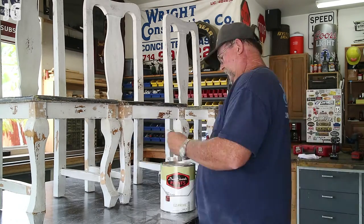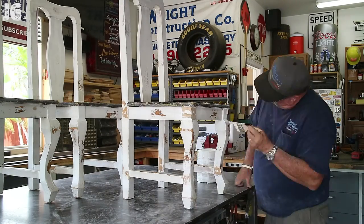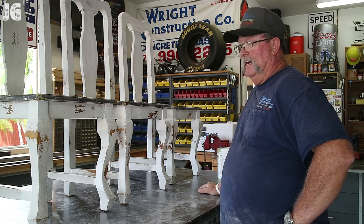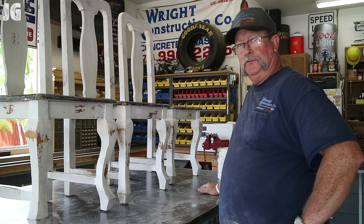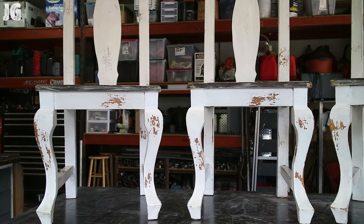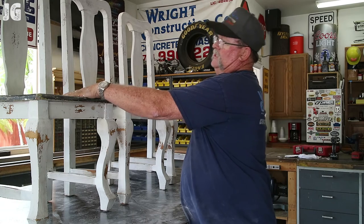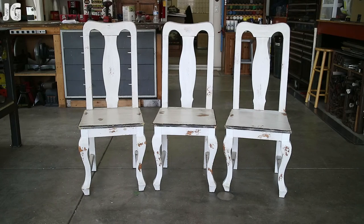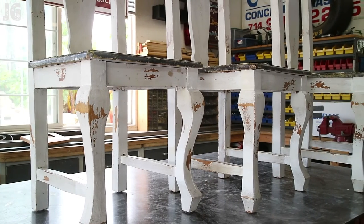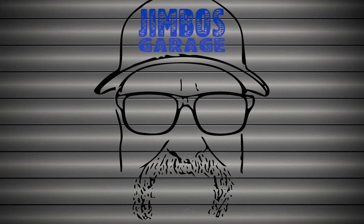There you go. I sure like to do a better paint job but I've got to replicate what's on there, and it's pretty rough — but I think that's the character of antique furniture. You can't even tell that any screws have been put in. You're still able to see the dowels that were sticking through — that's still part of the original. The chairs got stiffened up nice and solid, the job got completed the way they wanted, and it didn't affect the integrity of the chair at all. Still looks antique-ish, still looks original. Overall I'm really pleased with the way this turned out. Hope you enjoyed this video — thanks for watching, don't forget to rate, comment, and subscribe for more. See you next time on Jimbo's Garage.